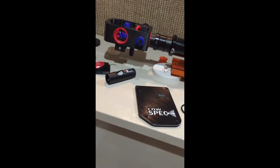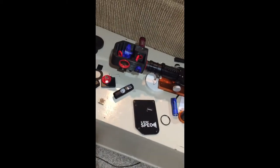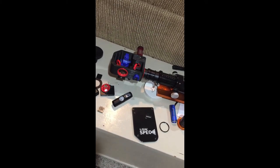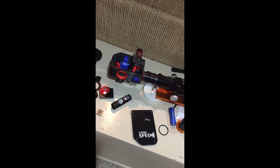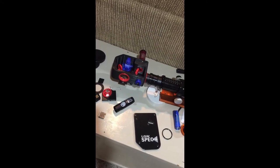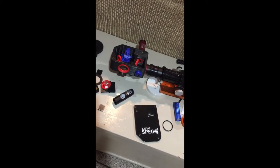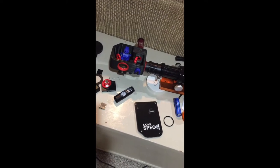If you did notice on the last video, Paul was super kind and left some great comments that really helped me out. Essentially, I'm going to reprint everything. Turns out that PLA is not what you want to print this in — it is transparent to infrared and near-infrared. Paul recommends printing in ASA with carbon fiber. I couldn't find that in the States; I know it's available in Europe. So I just ordered up some ASA and I'll print it 100% solid. I'm going to reprint it all in ASA eventually, but this is still a learning curve on the first go around.